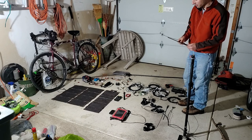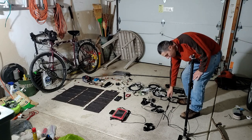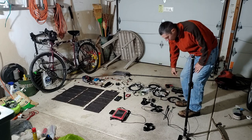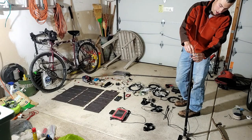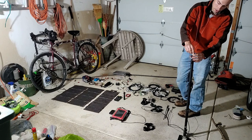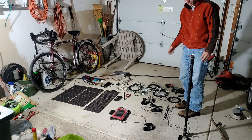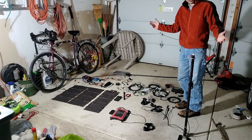And that's why I don't like using it a lot, because I don't want to damage it. It is already messed up a little bit. But the less I use it, the longer it's going to last. So that's why I don't particularly use it all that much. And as far as antennas go, a lot of times, especially in the hills, it's hard to beat a quarter wave vertical. Sometimes it's the simple stuff that works the best. So that's the reasoning for the welding rod quarter wave vertical on top of Romex 12 gauge copper wire. So it works. It's a great antenna.